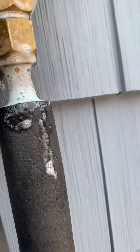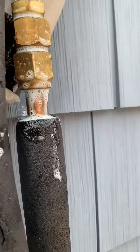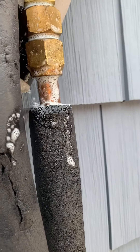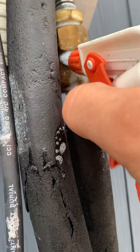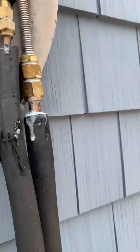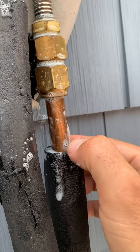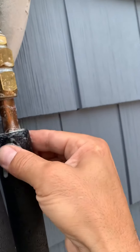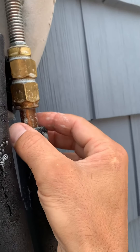We're just doing a pressure test — we're at 350 psi. There's no bubbles coming through; you always have a little from the air outside, but I think we're all good. See there's a little line there — they might have cut it when they were trying to do the flares and everything. Yeah, I think we're good — no real bubbles.